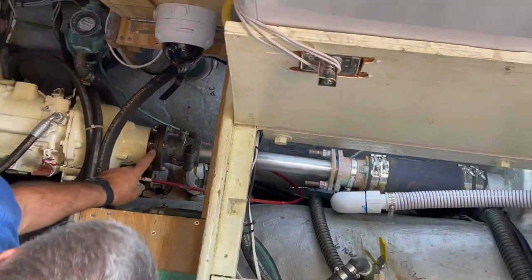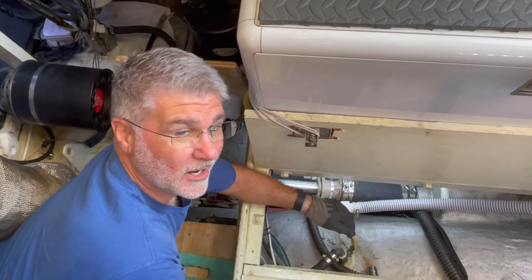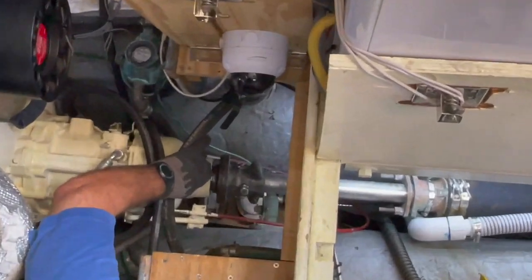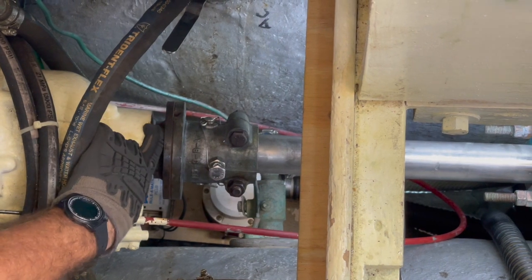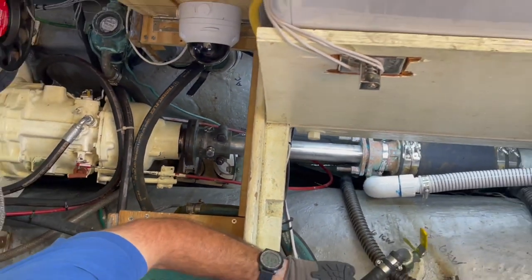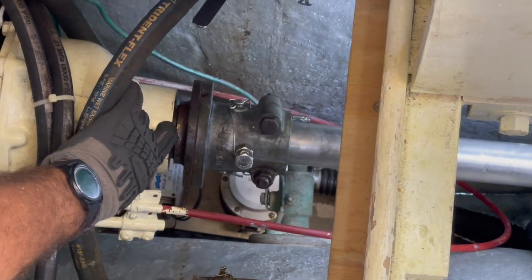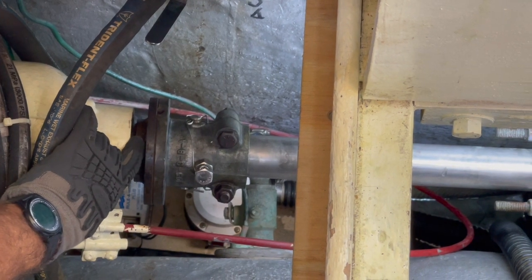The next step is taking out these four bolts. I removed the four grade 8 bolts that held the coupling together. Down here, this works with two halves of the coupling — you can maybe see the two different surfaces — and they're held together by the grade 8 bolt. I'm using these grade 8 bolts with just a nylock locking nut because there's very little room between the back half of the transmission casing and the flange. I just have enough room to fit a nylock in there — no washer.